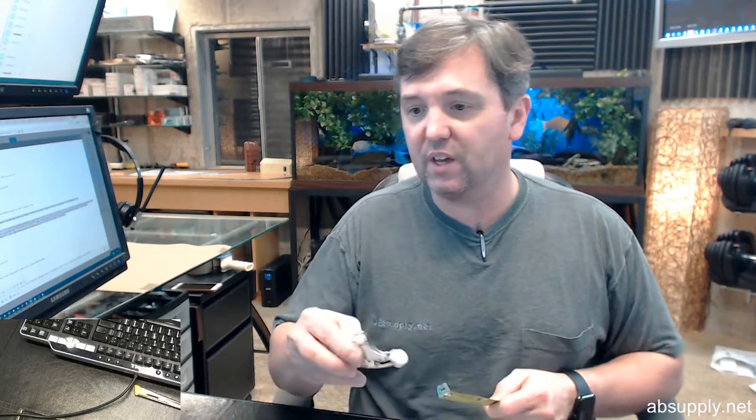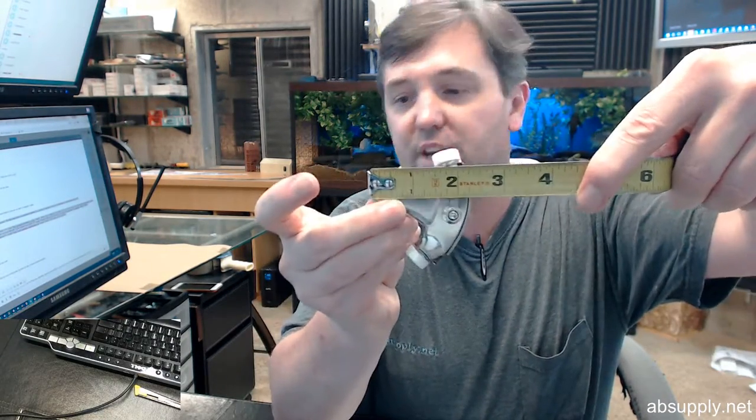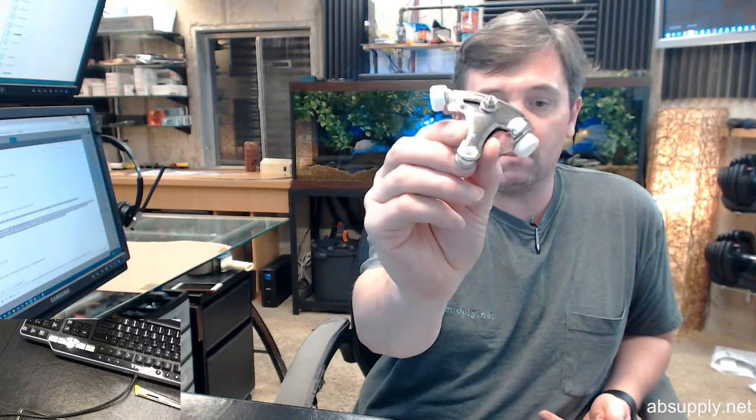Okay, there is a variety of information down below this video. We have covered all the applications, except to say that it's comparable to the IVHP23 or 69F series hinge pin door stop. There is a link below this video to a document called Cut Sheet, which is very handy, as it will give you the important dimensional properties of the item, and you're really dealing with something that's about 2 1/4 wide, as you can see, and then 2 1/4 the other dimension. It gives you the overview: adjustable angle setting, commercial or residential doors, 1/4 or 5/16 diameter hinge pins that will work with even smaller ones, 4.5 or 4x4 commercial grade hinges, and 3.5. Easy installation. Plastic bushing can be removed should it need to be. Individually polybagged. They look like this. Available in the finishes mentioned earlier.